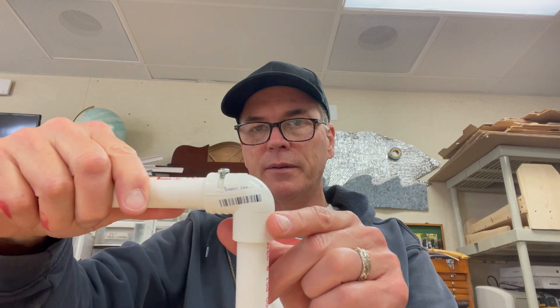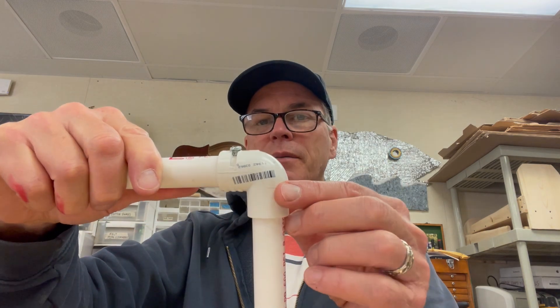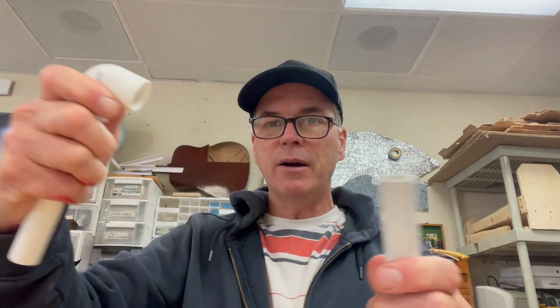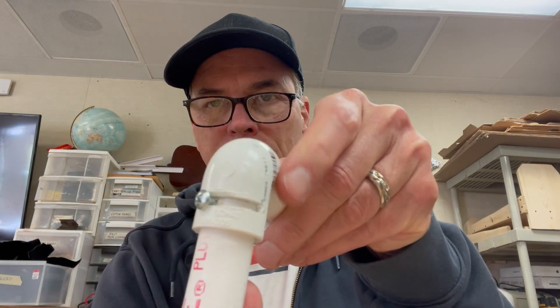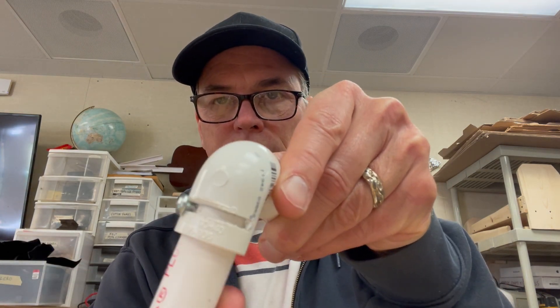The trick with doing this is I just have a regular 90-degree PVC angle on there, but you don't want it to pop out. You want it to stay on there, so there's a little channel cut into the elbow joint and a screw put in — and that's what holds it together.